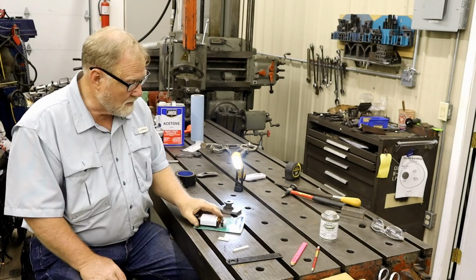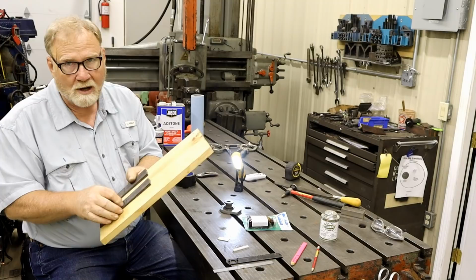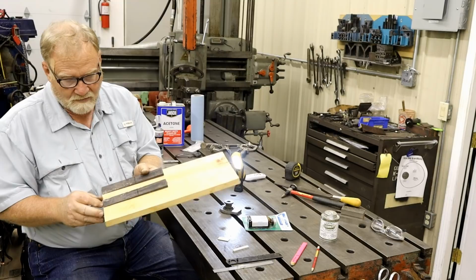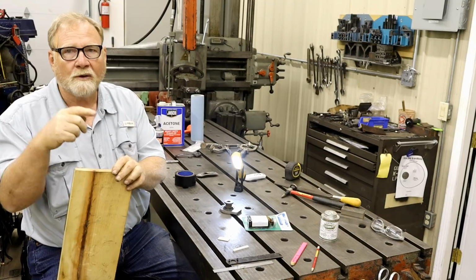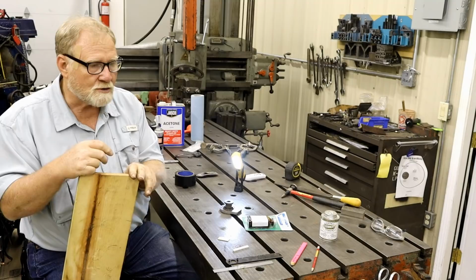Who knows? Now, in the last video, I showed you my little board I made using some carpenter shims, is what I call them. You buy these. These are composite. We used to use shingles, but then shingles got to be expensive. Anyway, these are a hard thermoplastic, and it worked pretty good for getting me that angle I wanted to make a nice taper. You can't stitch these things, guys. You can't put a little groove in it. Anything that goes over that pulley on the spindle is going to impart vibration to your surface finish. So I can't use the fingers or anything like that. In my mind, the only proper way to do this is to put a spliced belt together. And that's what I'm going to do.